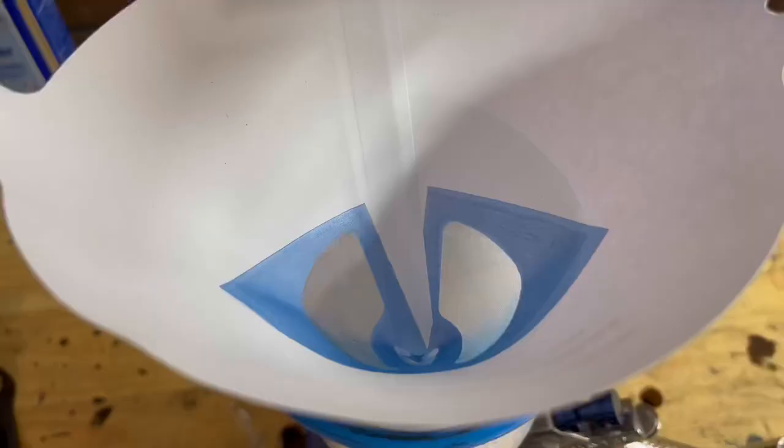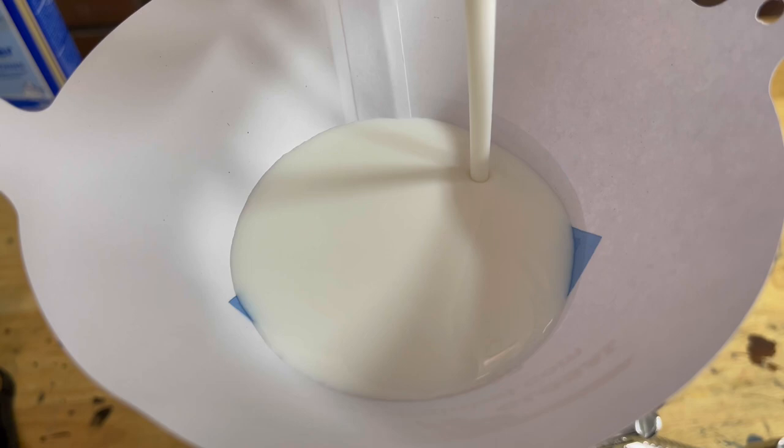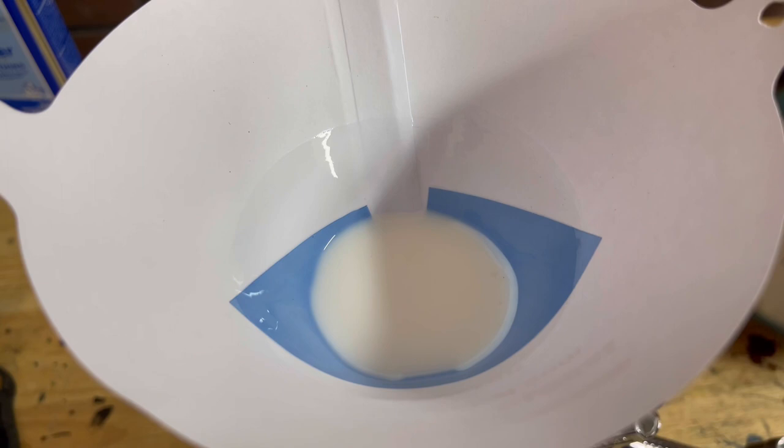I always like to use polyurethane in a satin finish for extra durability. I tint the clear coat with a bit of black paint in order to reduce any fogginess or streaking. I also sprayed it over the stained wood to darken it a bit. I had never tried this before, but I am very happy with the results that I got.